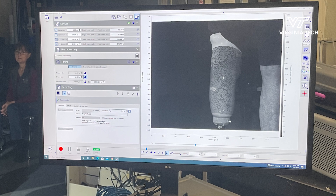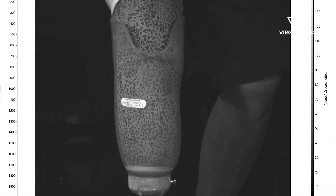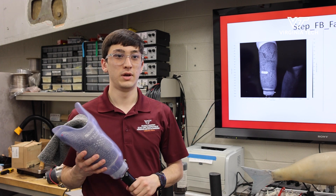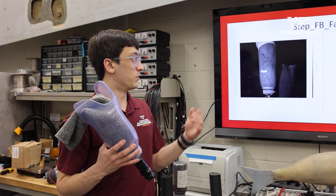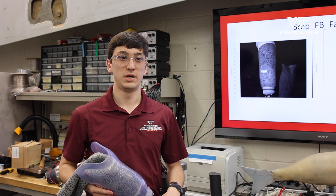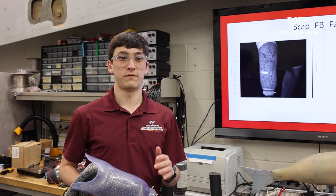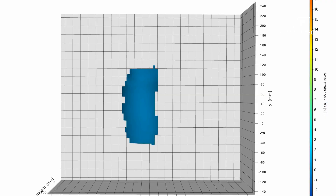After collecting the data, our team will go back and look at it and do the analysis. The original data will be in the pictures we've captured, then we'll run the DIC analysis to analyze the strain points, and we'll also compare the DIC analysis to our finite element model — more of a computer simulation.